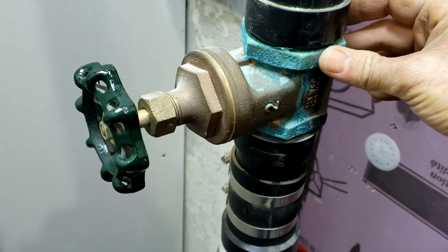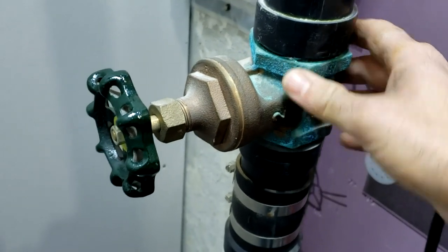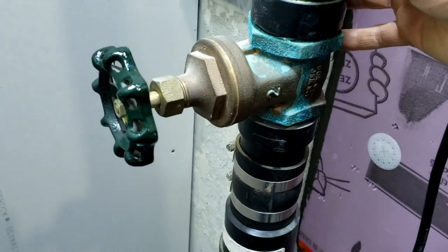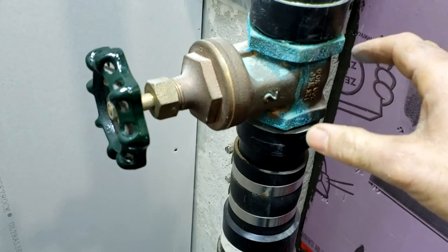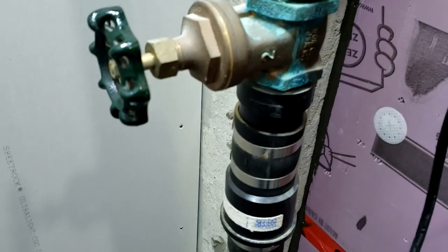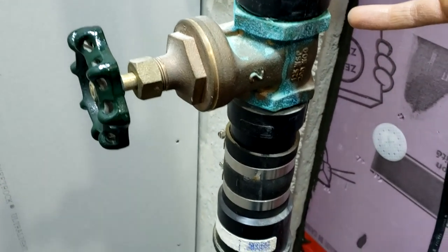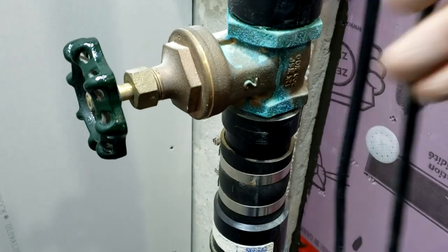As you can see by the staining on this valve, there's evidence of some past leaking. The valve itself isn't bad, but it's not really dedicated or designed for a sewage ejector system. Today we're going to replace this valve, check valve, and union connection with a specialized integrated valve that I mentioned earlier, which has everything in one and will make servicing much easier in the future.